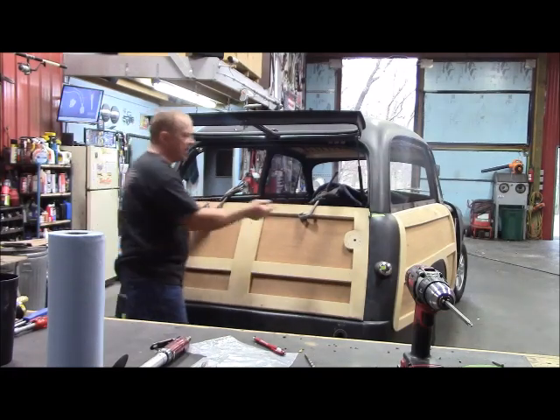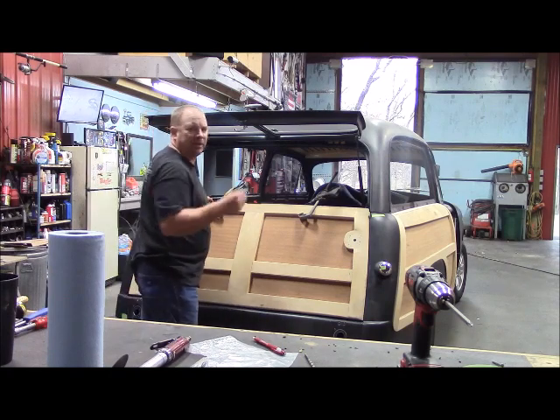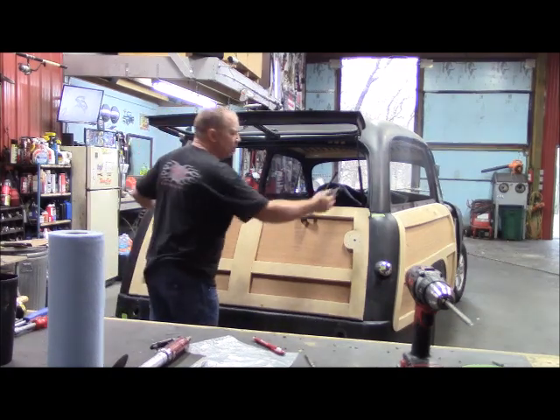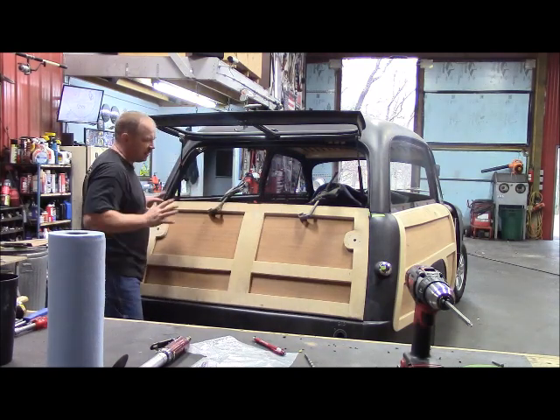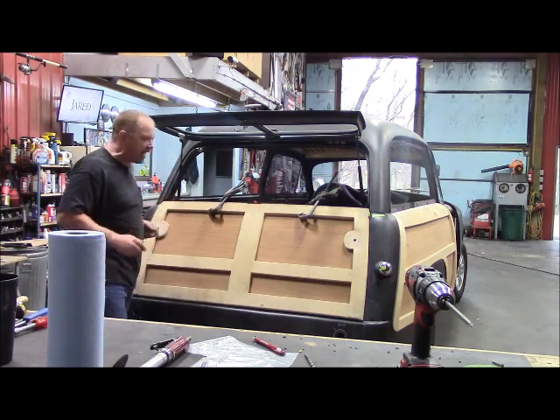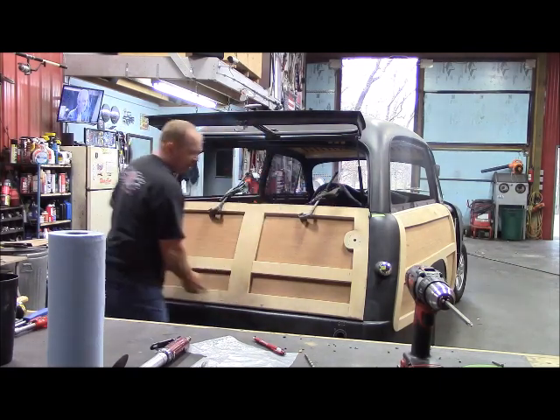Got this pretty close. I've made some little blocks in here — I took two paint paddles, put five flats of tape on it. That puts it right at five millimeters. That's my widest spot. I went there and locked that down. I got this where I can remove and install it real easy. Got me a jig outside where I can grind and fit. And I'm going to go ahead and gap this all the way around at five millimeters.